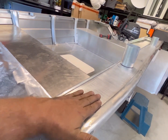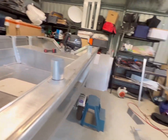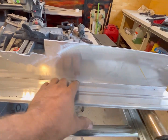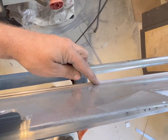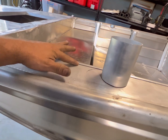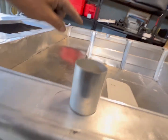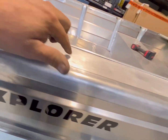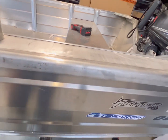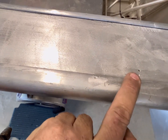So, and then I'll put that foam stuff around the outside here. Happy days. So what I did is I just welded it from the inside. So every 100 I gave it a good tack all the way across. So that way you don't see them on the outside here, which is this here. So it looks nice and neat. And then everywhere there was an upright, which those uprights and that little piece, I've welded it all in. There was another one there, weld that in. And one there, one there. So you can't even notice they're there. Like, you couldn't even pick it. So, besides the old pinprick, that's it.